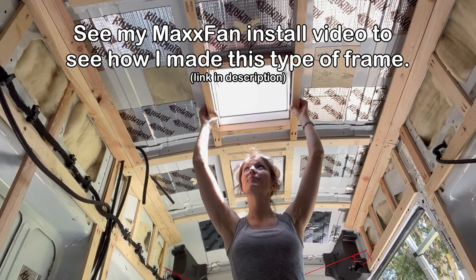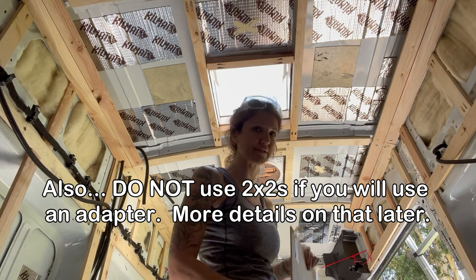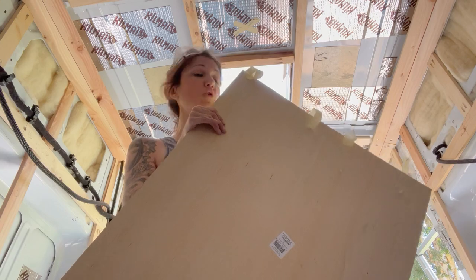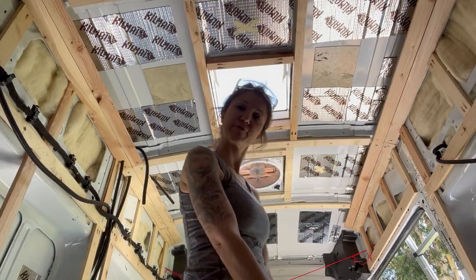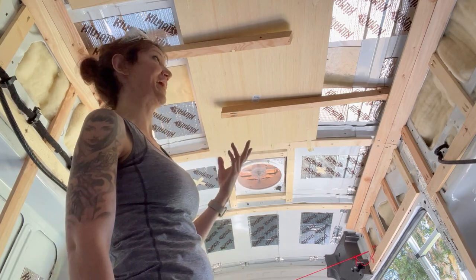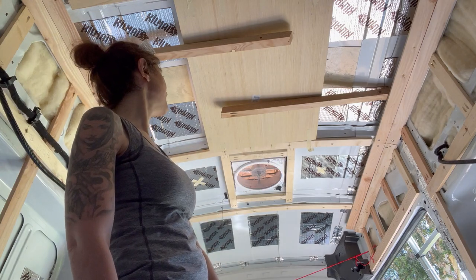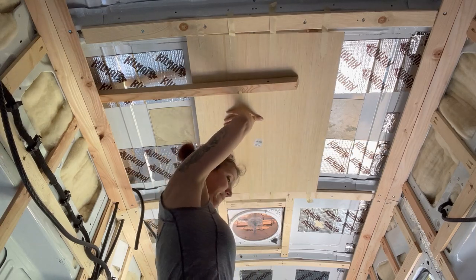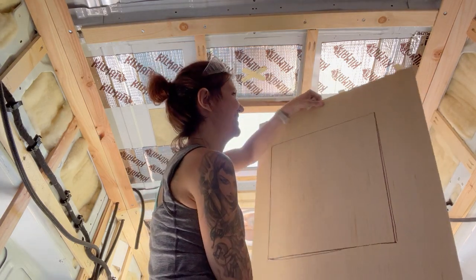I put the framing up. I used two-by-twos this time for the frame underneath. Now I'm going to tape this up so I can get back on top and trace out a hole, then cut a hole in it because the skylight goes up right here, and I'll put some decorative stuff on top for a nice accent on the ceiling. Masking tape didn't hold at all, but I was able to wedge two boards in there to hold it up. I went to the roof and traced out a square. It's not the prettiest box I've ever drawn, but it'll do.